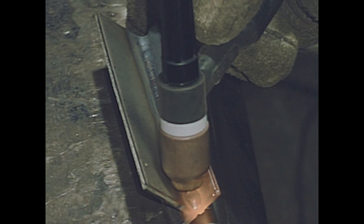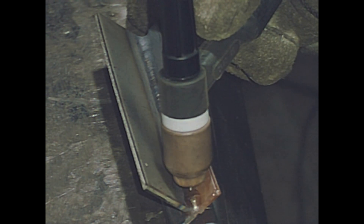Here's the whole weld all at once. You see me bounce back and forth, get the puddle started, and now we're just going to flow down this joint. I'm just dabbing right down across the joint, staying on the leading edge, moving steady until you get to the end. Again, you're going to do a circular motion when you're extinguishing the arc, and kind of let that post purge disperse until it turns off — preventing atmospheric contamination on the end of the weld. As you're getting towards the end, you kind of have to ease up on the pedal too.